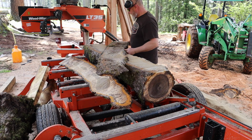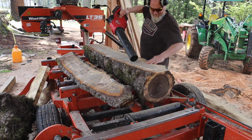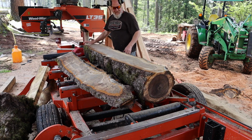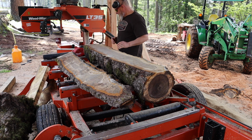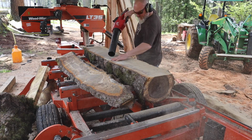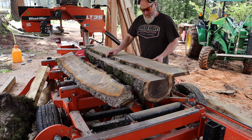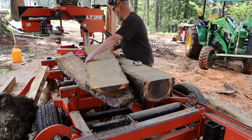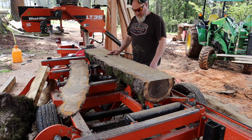Oh, this smells quite a bit different. And the wood almost looks kind of green. As it oxidizes, it'll turn more of a dark brown. Because these logs are smaller diameter, I'm just cutting them into 5/4 boards, 1.25 inches. 13 inches, 14. These will be nice usable boards. So I'll flip this over 180 and finish sawing.